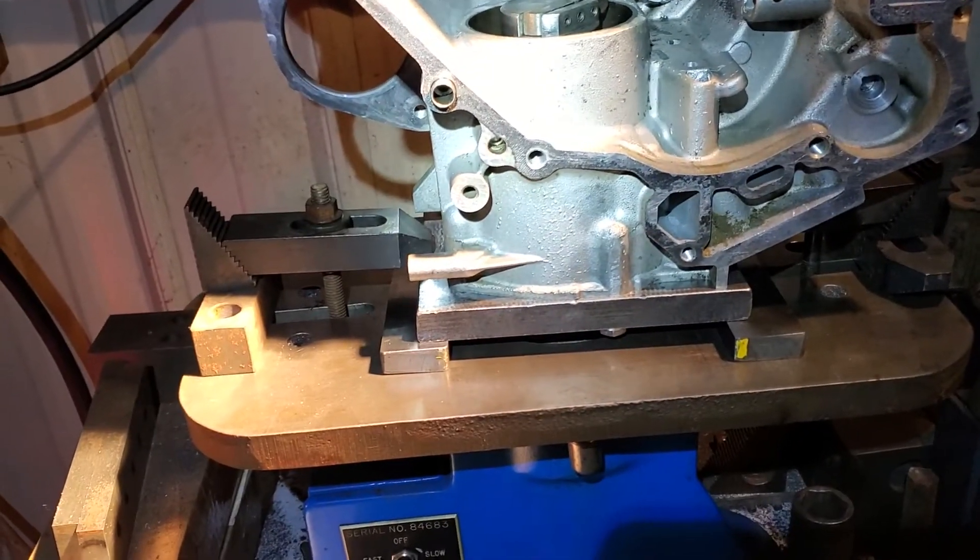That's a little more interesting — usually it's more toward the thrust side where it's worn, but either way it will clean up. We have 50 hundredths of a millimeter to go — actually about 40 hundredths — going 50 hundredths oversized. I do about five thousandths per cut, maybe a little more, and that's as heavy as I go on this small boring bar. So we'll finish up this block with about four more passes.